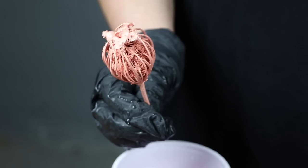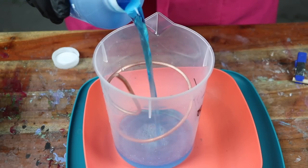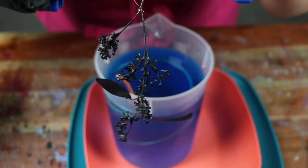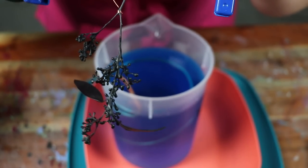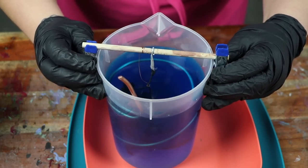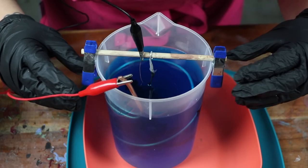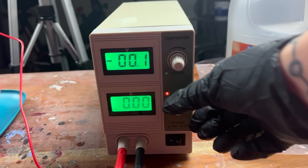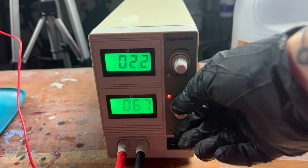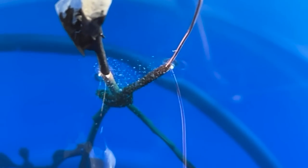So this one was in for six hours. Welcome to one of the only successes that this video will see. We have some seeded eucalyptus — a really pretty stem of it. I'm getting my electroforming solution in there, a little bit of distilled water to get it up to the 1000 milliliter line. Here's the seeded eucalyptus coated in all the things. We are submerging it with all the correct things — the copper wire connected to it on the bus bar. We connect the red wire to the copper coil and the black wire to the skinny copper wire that is connected to the piece. On our power supply, everything is basically zeroed out — I put the amperage up to 0.65. One of the most difficult things about electroforming plants or flowers is you're supposed to calculate the surface area of the piece, and it is very difficult to figure out the surface area of eucalyptus.